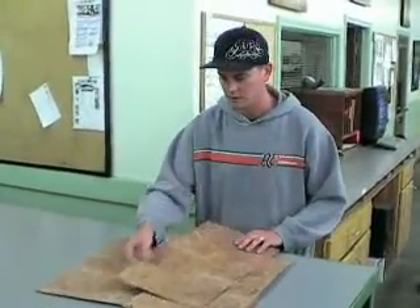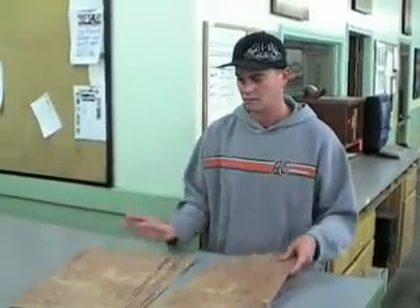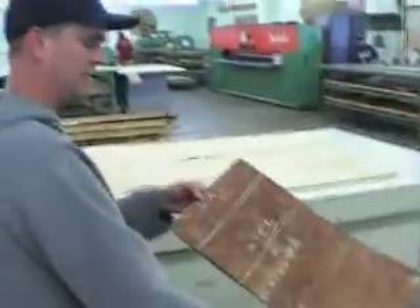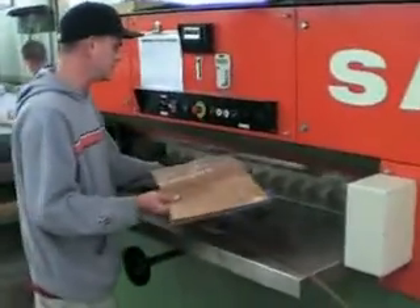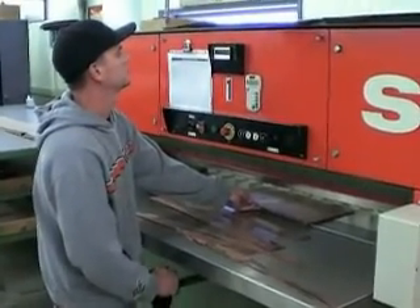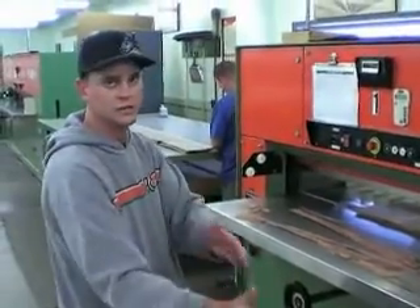This is my inch oversize. What I'm going to do is flip and slip every leaf to arrange it so whenever I cut it, it will be face-side up on every leaf that the blade passes through. I'm going to take them over to the saw, cut them to my finished width which is ten and a half. The panel size ordered is a 21 by 21, so it's going to have a center seam in. We always put a bumper under it because the last leaf of the stack will tend to blow out because of the pressure as the blade passes through.